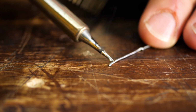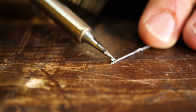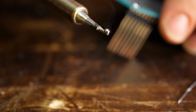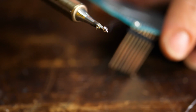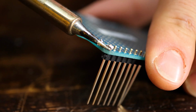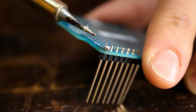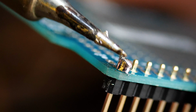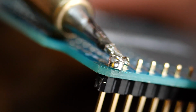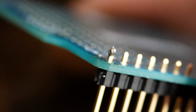Small pieces of the solder come off and melt on the tip. This doesn't look as good as soldering should. Despite the fact that it turns into a small shiny ball on the tip of the soldering iron, if you try to solder something, the solder will solidify too quickly, turning into a gray mass. This won't create a reliable contact, meaning that if we use this solder to solder at low temperatures, the elements we are working on won't adhere well.